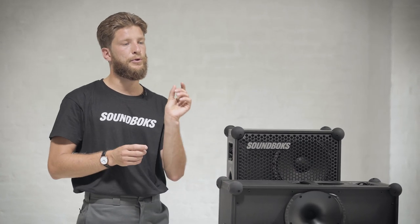Another issue when designing battery-powered speakers is that the supply voltage from the battery is not sufficient to supply the peaks of the music signal required when playing at maximum level. To solve this, we have implemented a boost converter. This boost converter will momentarily bump up the voltage to 24 volts. It does this with very brief transitions — because the nature of music has beats and silence — so during the silence period we go down to 12 volts to preserve power, and during the kick, we turn on the boost converter in a matter of milliseconds and bump it up to 24 volts right away.